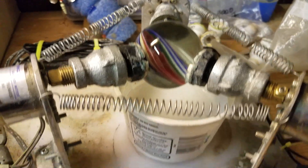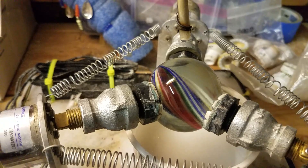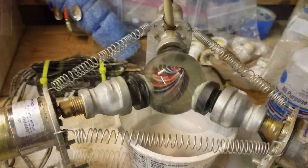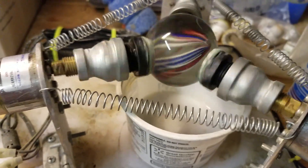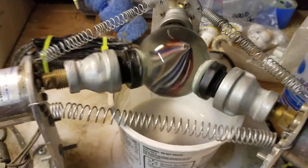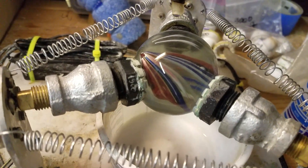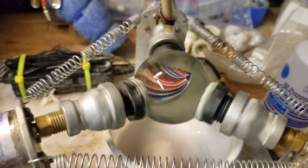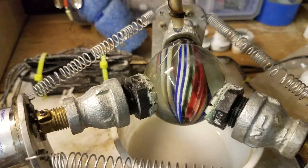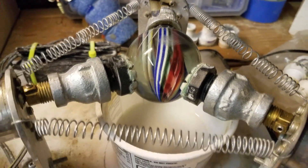I'm going to take the 800 grit cups off and put on 1,500 grit. Here we go with the 1,500 grit — when it's done with that, you'll be able to see into that marble even better. Let's come back in about seven or eight minutes. That was eight minutes on the 1,500 grit and you can see just how much shinier it's getting.